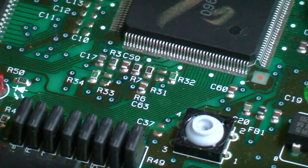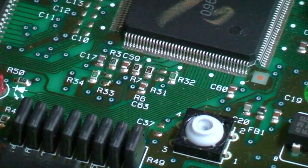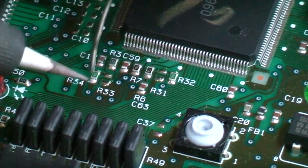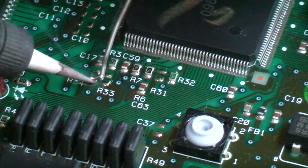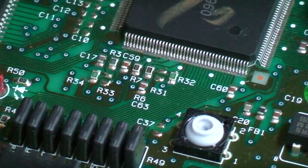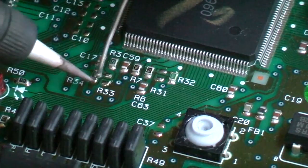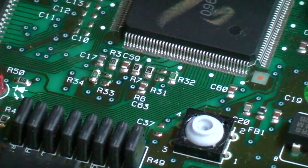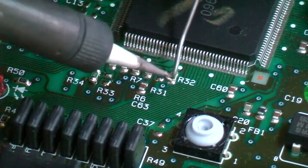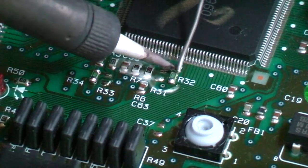So we'll get this resistor removed and get some wiring tapped on. The first thing I'm going to do is get rid of these zero-ohm resistors. What I'm going to do is add a little bit of solder to either side. These unfortunately aren't too easy to work with because they're surface-mounted resistors, so they're a little bit fiddly. But on the positive side, because you're removing it, it doesn't really matter if you damage it. What you don't want to do is damage the track underneath, because we still need to use that.